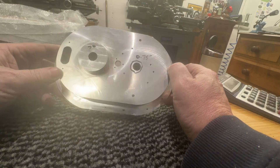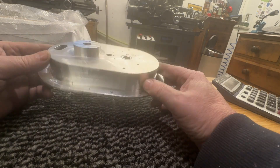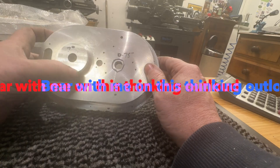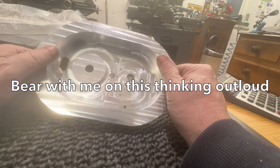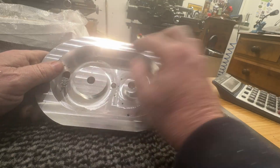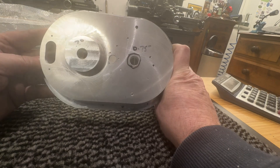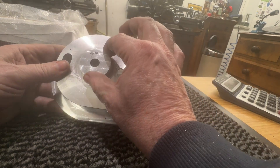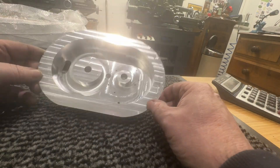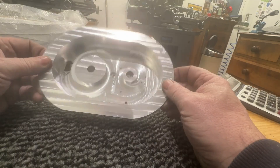It won't fit in my lathe — it won't fit on the face plate. So what I've decided to do, which I think there was a comment not so long ago, is I'm going to have to make a slug that's got the taper in it and bore this out. After all this work, I have left this slightly oversized so it will fit into that — it'll have plenty of purchase on it — and fall back on the good old Loctite. I spent ages getting this right and it's taken longer than I thought. Don't underestimate how much weight you take out of this — I think it's a good two bins worth of swarf.